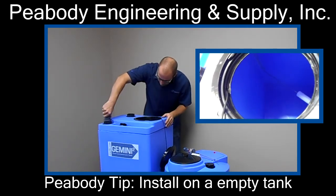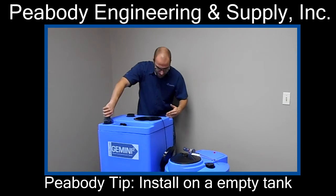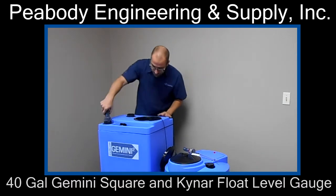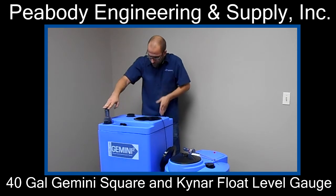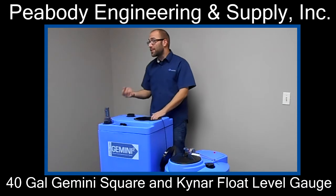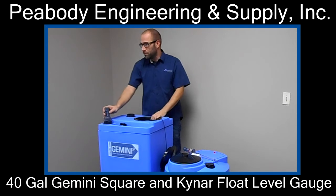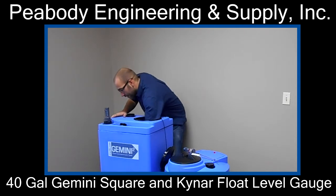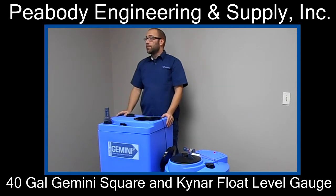Look down the man way and aim that arm for the opposite corner — maybe a little off so it's not in your way when you're filling chemical inside your tank. You don't want it to hit the float gauge. I aim just off this corner right here. It doesn't have to be tight all the way down. If you want it a little tighter, you can put some Teflon tape on it and it'll tighten up the connection so it won't be loose. This is properly installed — that is a properly installed float level gauge.